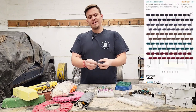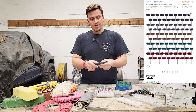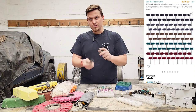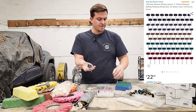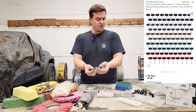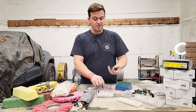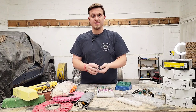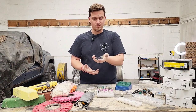These here I think they call non-woven points. They have a 3 millimeter shank and need to be spun at around 8,000 to 10,000 RPM. They last quite a while and come in a variety of different grits — this one's about 400 or 600, this one's 220, and I think the greens are around 320. These work really nice for blending sanding spots, taking off dirt, stuck-on corrosion, or blending after using something more abrasive like a rubber bit.